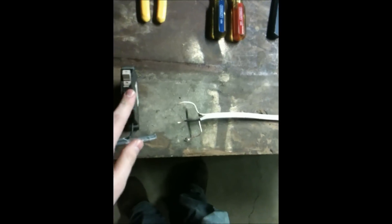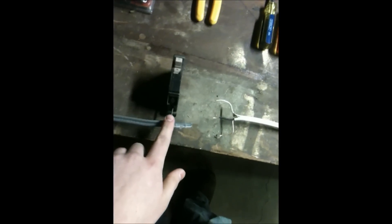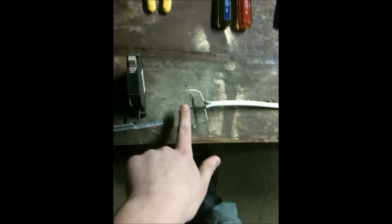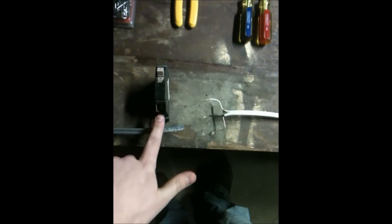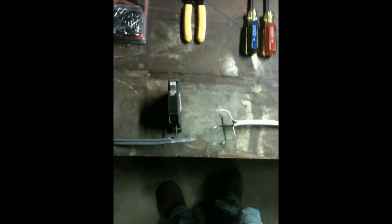Just a real quick typical installation. This would be the wire coming from the transfer switch going to your appliance. This is already in. What you would do is take this black wire out, wire nut it with this black wire. If that was the red wire, the red wire would go inside of here. So I'm going to mount the switch and then we will continue recording.